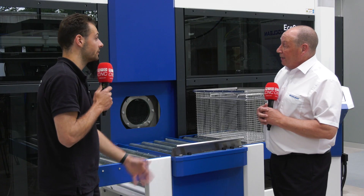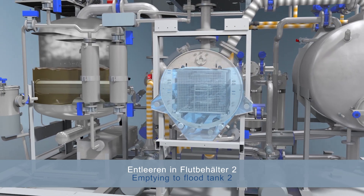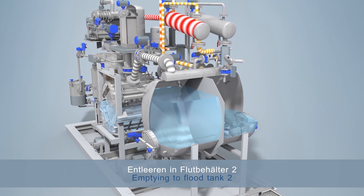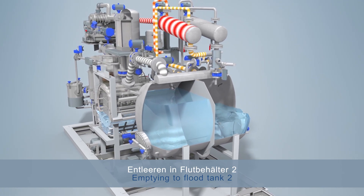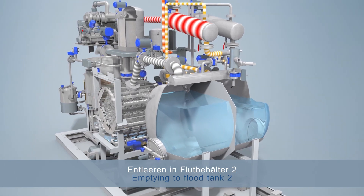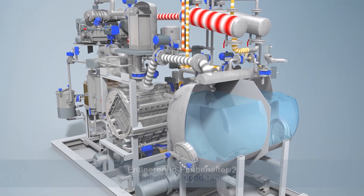So there's loads of different options. Absolutely, and you don't want the parts wet. It's not allowed to bring the parts wet out of the chamber. We don't want any solvent losses through washing, and so the parts are dried — 100% perfectly dried — through the vacuum technology. We remove the air from the chamber which effectively dries through evaporation.